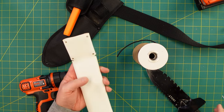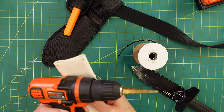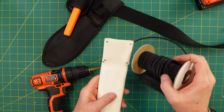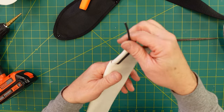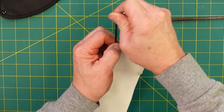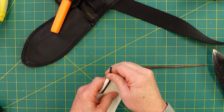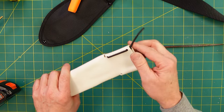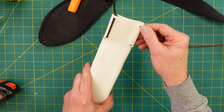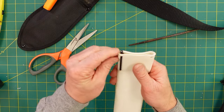I'll post that down below. I need to protect the bungee, so I've drilled three-sixteenth inch holes with this step drill — right there, right there, and right there — and then I'm going to feed the bungee cord through. On both ends I'm just knotting the bungee: I stretch it out a good bit, put an overhand knot, which lets me bury the knot into the plastic and pull it back through. This is about a five-inch piece of bungee — you probably could go with four inches — and I finish it off with a little fire to melt and bury the end.